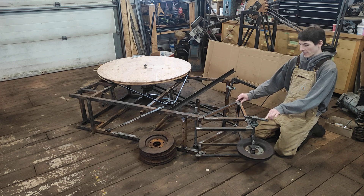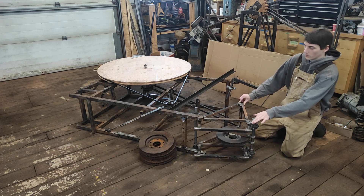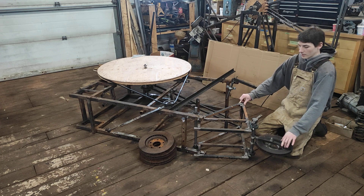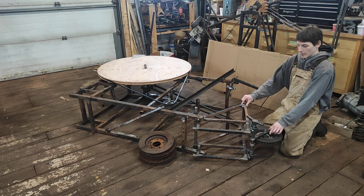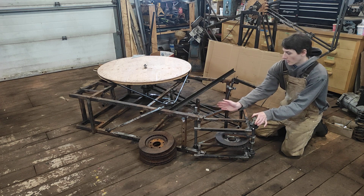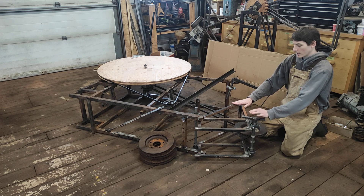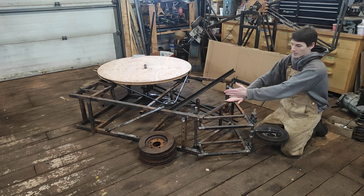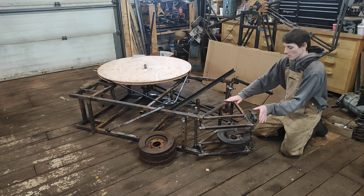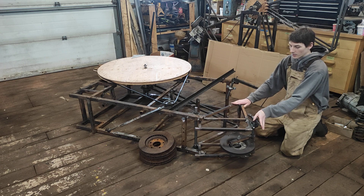The first method is: this spins and it wants to move the frame. But in order for this weight to not slow down, the center has to move in the opposite direction. As this comes around, all the force is this way, and now it's going this way. It has to be held here for a quarter of a turn, and then it can move. And then when it gets here, it has to be held for a quarter of a turn, and then it can move. So the center is not following the weight — it's going in the opposite direction of the weight.